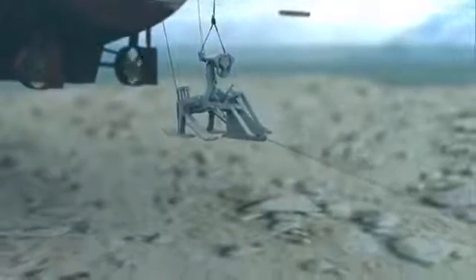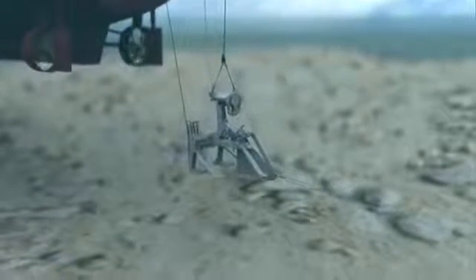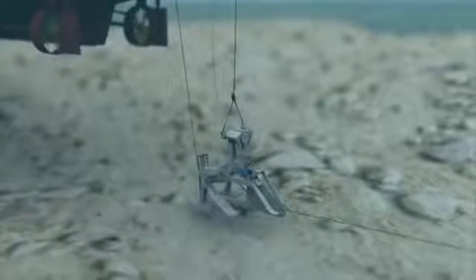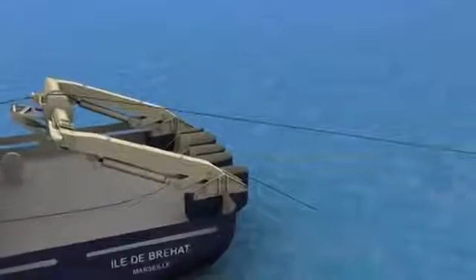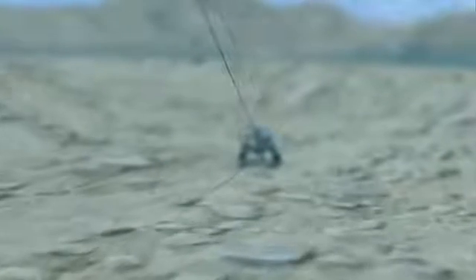The HD 3-series plough can simultaneously lay and bury cables down to water depths of 1500 metres. Once the towing catenary has been established, the plough team on the vessel articulate the plough, allowing it to penetrate the seabed to the required burial depth. This plough series can plough to 3 metres burial, subject to soil conditions.